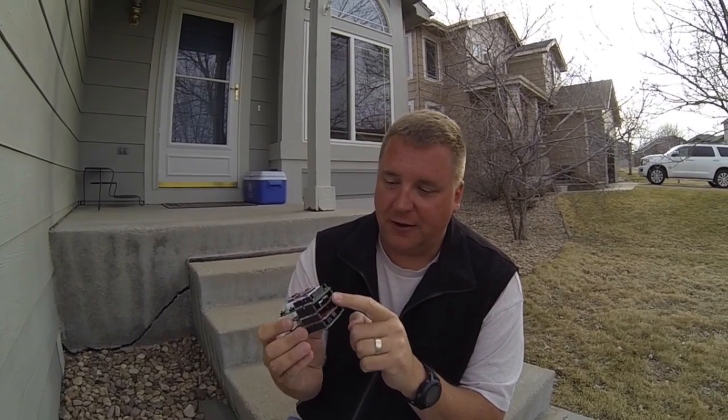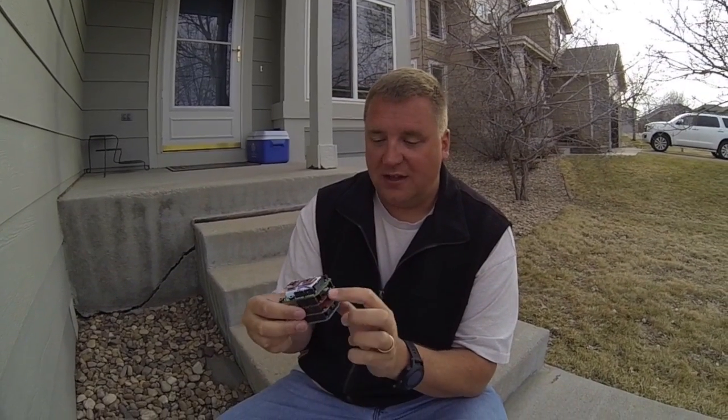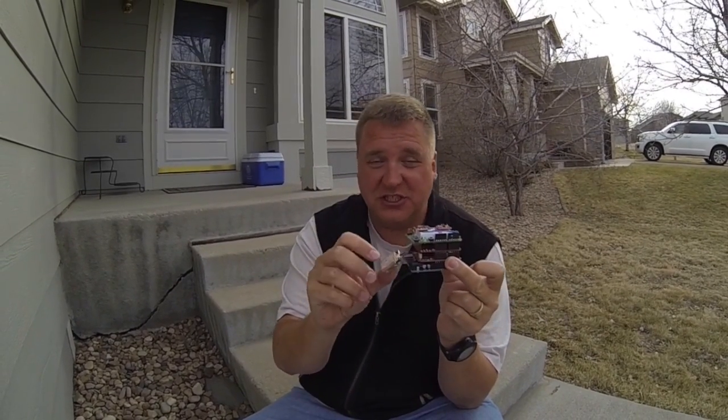That board I skipped over there is an XBee radio. It's a radio that's designed for electronic sensors. It gives us a range of about a kilometer to a mile depending on obstructions. It runs off a very low power footprint. It's fast enough for sensor data, but you wouldn't really want to use it for something like video. So the wireless radio can transmit temperature, humidity, accelerometer data — X, Y, and Z — the compass heading, the GPS position, the GPS speed, the GPS heading, and the date and time that the GPS is recording.